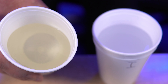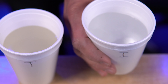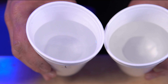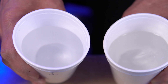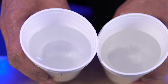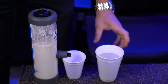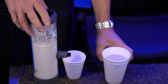If I tilt the cups so you can see better in the camera, you can see the color is pretty much gone in the iron sample. Comparing the two side by side, the iron sample has less color, and you can see that chemical removed all the iron from the water. Next I'll show you what happens when we pass the water with tannins through a tannin filter.